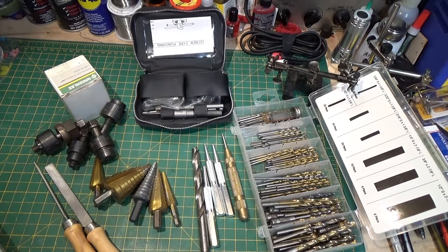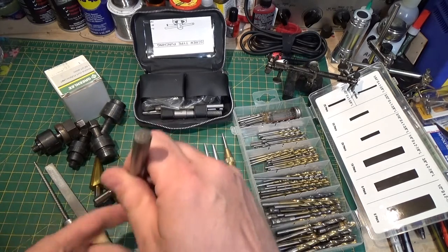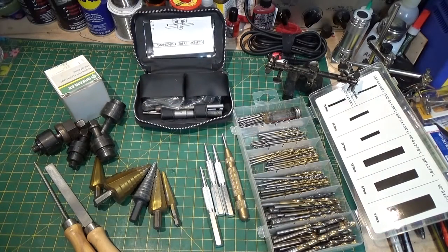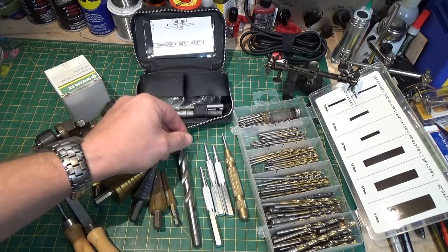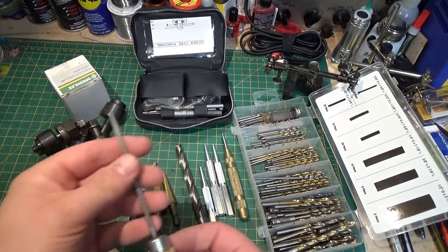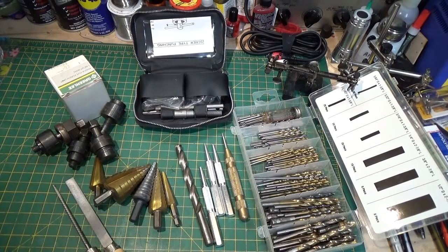So how do we do that? There are some different ways. In the past, when I started out as a kid, I just didn't have any way to drill the holes. I would draw my circle, cut several holes around it, then nip them out with a set of clippers, wire cutters, or some tin snips. Then I would finish off with a round file or a half-round file and clean it out. It wasn't perfect, but I was able to mount the tube socket in there.